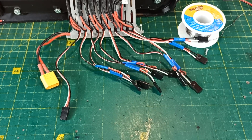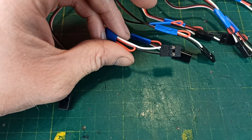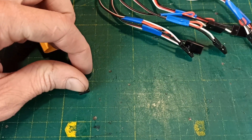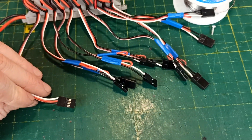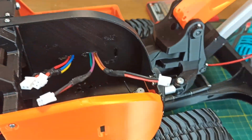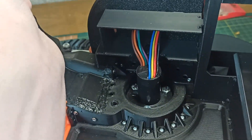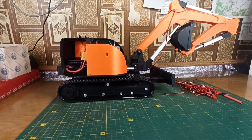Don't forget to remove the red wires from the cables that go to the receiver. You must remove the red wires from all cables except one — the red wire sends power to the receiver, and the receiver only needs one power source. Otherwise, we can simply burn it out. Here I soldered the connectors to the wires from the rotary connector. Now I can connect the unit with the motor controllers and do the first test drive for the chassis.